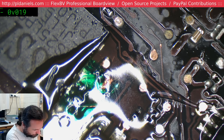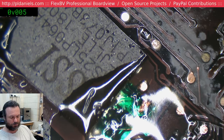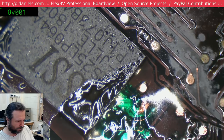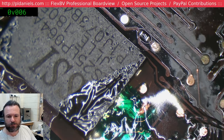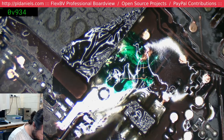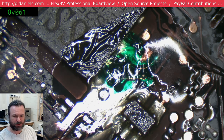Damn it. I'm going to check a couple of other voltages though while I'm at it, because I really wouldn't think that that would cause it to do the behavior it's doing right now. I'm just feeling the board up, to see if I can find any hot spots. Check 3V3SO since it's right here. You should see it come to life for an instant and then die. Yeah, it's trying to come up. Something's shorting it down.